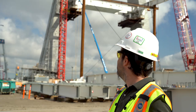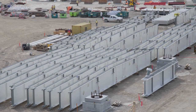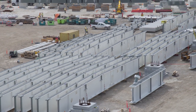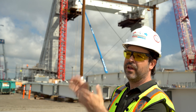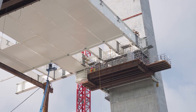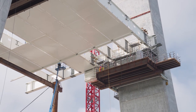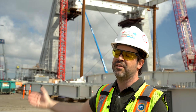The pieces we typically see here include the edge girders, which are approximately 15 meters and weigh 40 tons. Those run longitudinally along the bridge. Then we have the floor beams — the central ones are a little bit bigger, but the typical weight is 25 tons on the side span, and it will be the same on the main span.